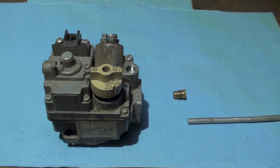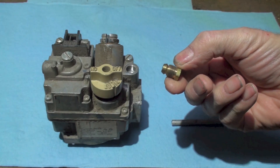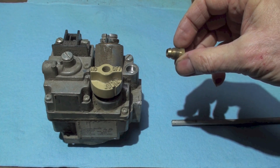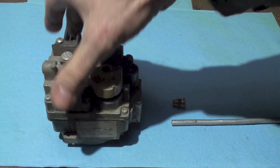This video is about hooking up pilot tubes — that's just aluminum tubing — and the flare and ferrule we use to hook them up. These are usually pilot furnaces that actually have a pilot light, maybe electric ignited or just a standing pilot. Here's a standard old gas valve that you would put this into.